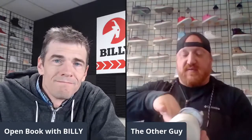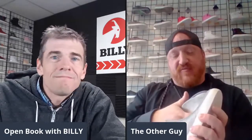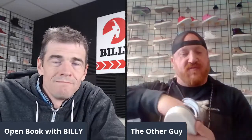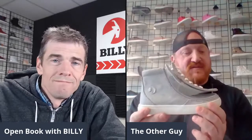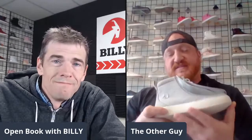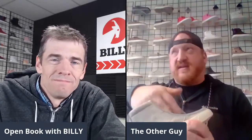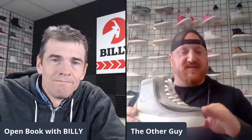What you can see — it might be tough to see on this version — is how that outsole has no gap, because it's all got adhesive and cement there. That last board, after the fact, is just a little bit of a border between your foot and the outsole. And in this cup sole, there are some cavities in the base — like a waffle cavity. That's done to remove material so it's lighter but can still provide support. We'll get into how we've dealt with that in the way this is constructed.